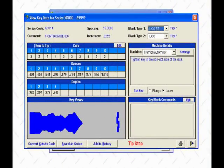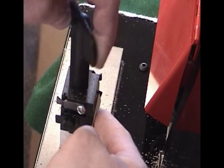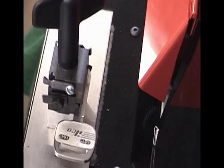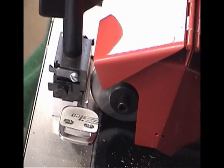The key cutting screen shows all the cutting specifications for the key we chose. There are only a few buttons we need to be concerned with at this screen: Cut Key, Cut Type, and Add to History. You can double check the code entered at the top left of the screen. Cut type will either be plunge or laser cut — automotive keys are cut using the laser cut settings, and all others default to plunge. With that set properly, insert the key in the vise. Make sure the key is bottomed out in the vise. We are cutting a double-sided key so the dot should be toward the user, and the key has no shoulder, so we will align it with the tip stop. Tighten the vise to secure the key.